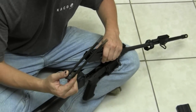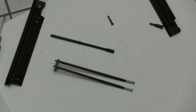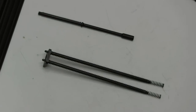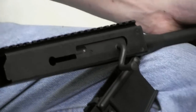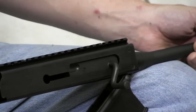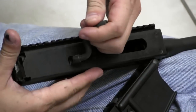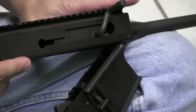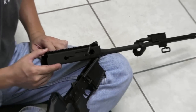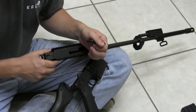This actually appears to be a fairly well-made part, and the reason for that is Vulcan didn't make it. We're pretty sure that Armalite did, and Vulcan simply bought it. Before I pull the bolt out, take a look and notice that that cocking handle is pointing downwards. That's backwards. That's also how it came brand new. If it were done correctly, like an AR-180, it would be pointing upwards like this, so that you can more easily cock the rifle from over the top. But it's not. They put it in upside down because they clearly don't know or don't care.